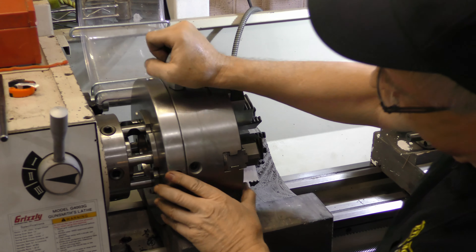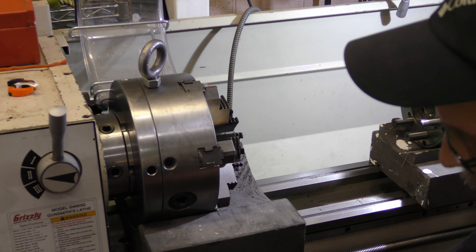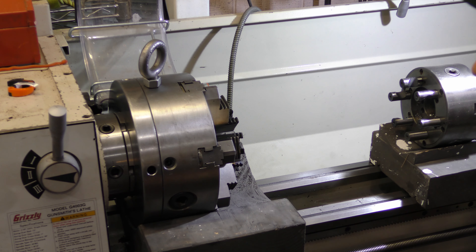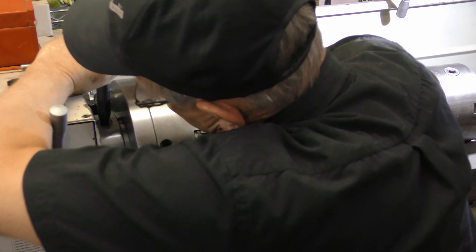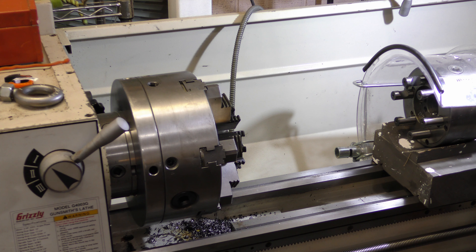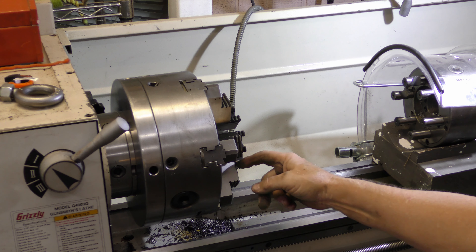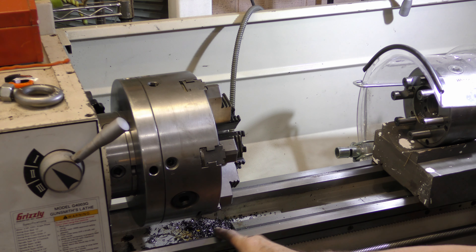Now bring it into the headstock. There's a witness mark on this too I think, so I may have to move the headstock around to find it. I built it on here and made sure it had a witness mark. There's a zero there — we're finding a zero on the headstock. The one on the headstock came from Grizzly that way, so their factory high precision chuck already has a witness mark. If I can find it... there it is. It's kind of faint right there. If I line it up, I can make sure it's in the same way I built the thing.